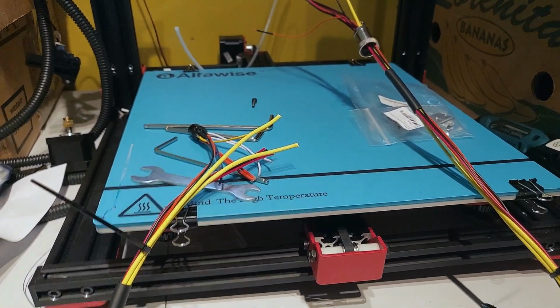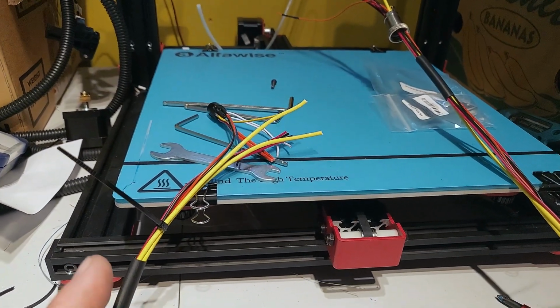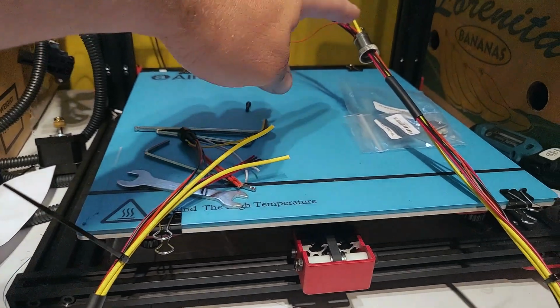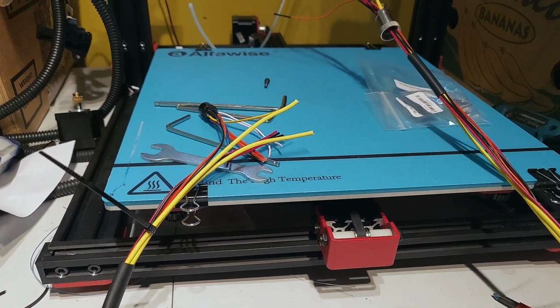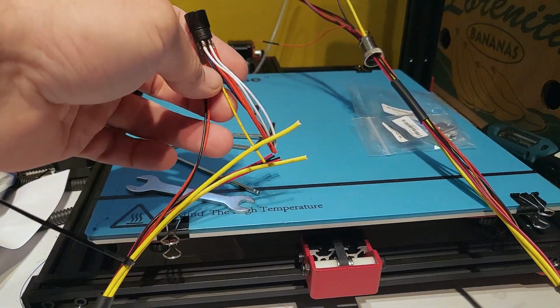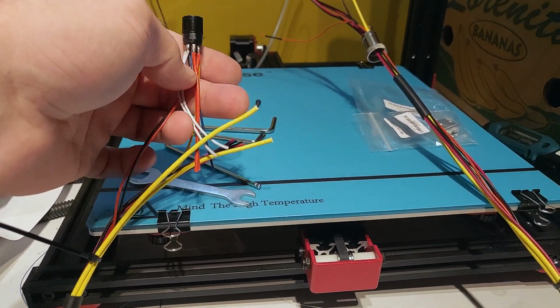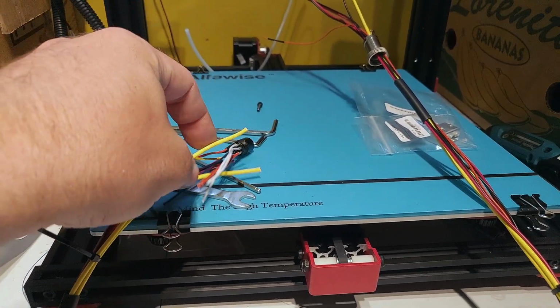Okay, I've reached the point that I need to do a bit of soldering. As you can see, I've put some heat shrink tubing around everything first. That'll go underneath the clamp, hold it all in place, and should prevent any cable damage. I've already cut off the heat shrink on these, so I just need to desolder there, then strip the new wires back and solder on.